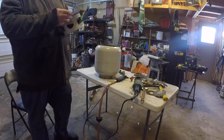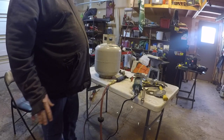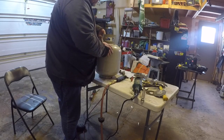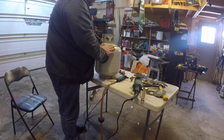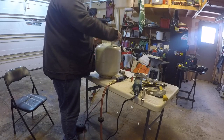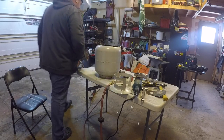In grinding this, I want to grind this flat this way, because what this is going to do is make a basic sealing surface against here. Is it fantastic? Nope. Does it need to be? Hell no. But it's going to help control the air just a little bit. And I'm not caring to spend a lot of time, a lot of effort to make the seal. I just want this to basically do that. So that is all that is.